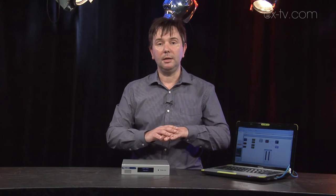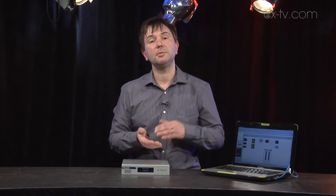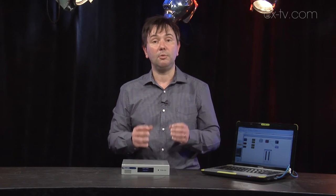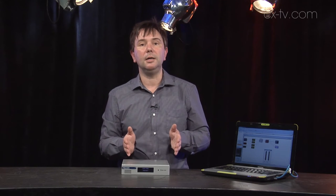It's mic pre's with phantom power. So they've all got that capability. There's also a 64x64 Dante interface on all of the devices, plus an ARC interface for Symetrix range of control and accessories. And this is the big standout point of the Prism series.